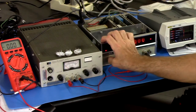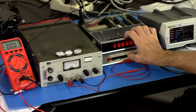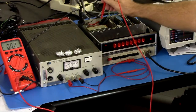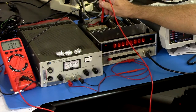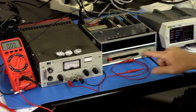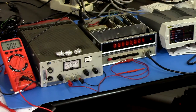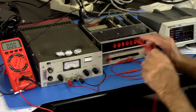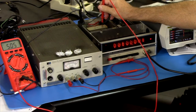Power on. Now I'm 100 milliseconds times 1, right? 100 kilohertz. If I now switch to times 10, it doesn't like it. And I've got 1.5 volts. Okay, it's consistent. Okay, but switch off. Let me switch on at times 10. There it is, 100.00 whatever. 5.05 volts.